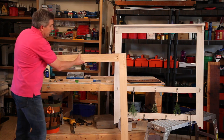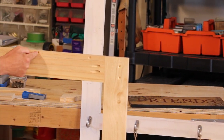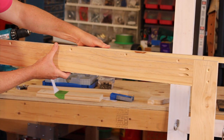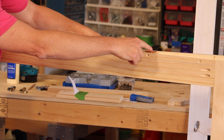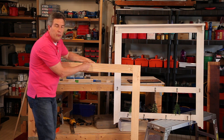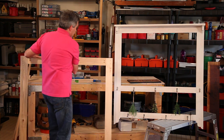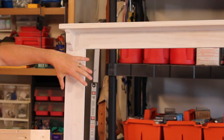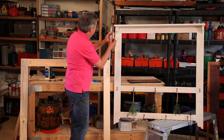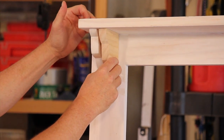I'm going to go back again to my display. If you notice here along the back — this is the back of the piece — I've drilled some pilot holes along here. I take another piece of 1x4 pine and I'm going to place it in position, run a bead of glue along this edge, and then screw it together using stainless steel screws. That way it will hold together through the weather. So if you look at it from the front, you have your top attached to this piece, all your pieces together. Then you're going to take your finial and complete the piece by drilling holes in the back and attaching your finials.